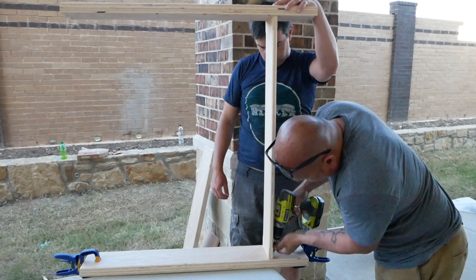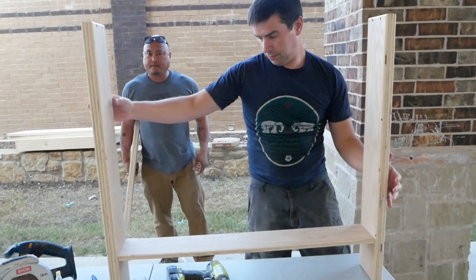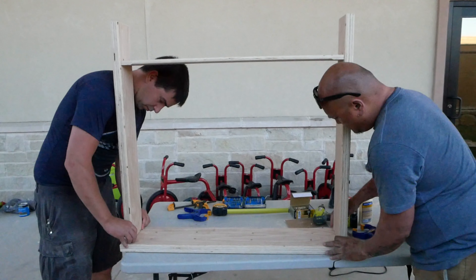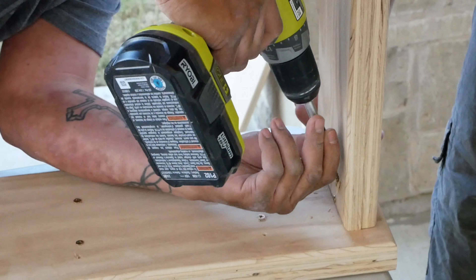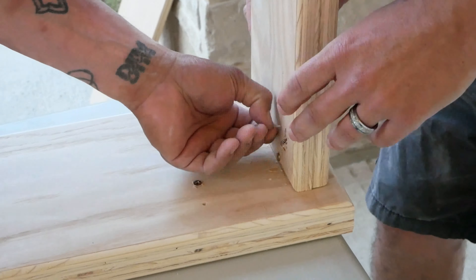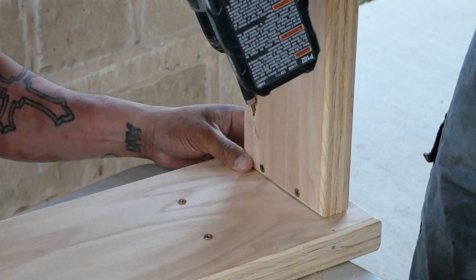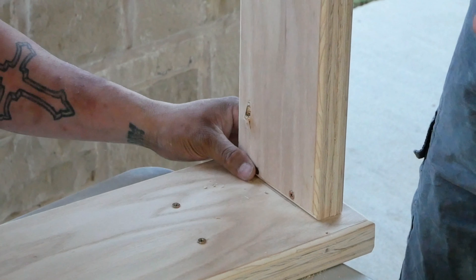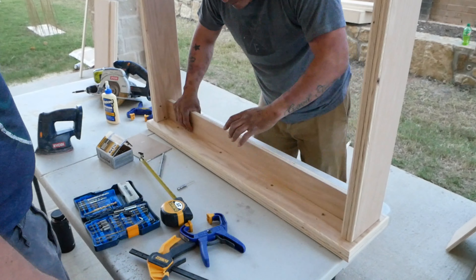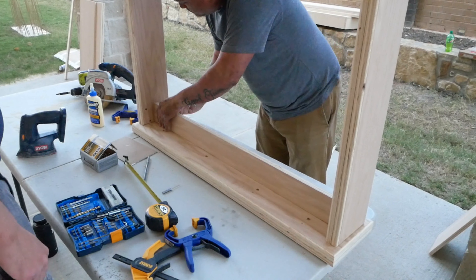The dog next door kept poking its little face in from the holes in the wall there — it's pretty funny actually. Here we have the table base. Now instead of screwing in the tabletop the same way we did with the legs, we had to go in sideways so that we could still hide the screws a little bit. And even though they're popping out now, Chris was able to sand them down a little bit later — and you still can't even see them when it's upright, which is awesome. We did that to both sides. After all that, the table just needed a little extra support so it wouldn't wobble. It just so happened we had the perfect size scrap piece of wood that we glued in between the legs and it sat right under the table top. So no more wobbling!